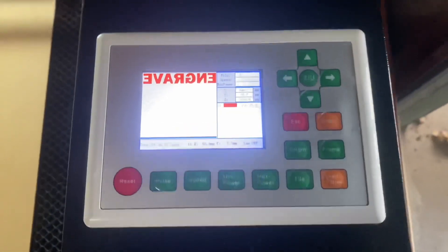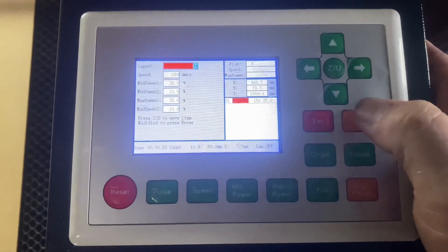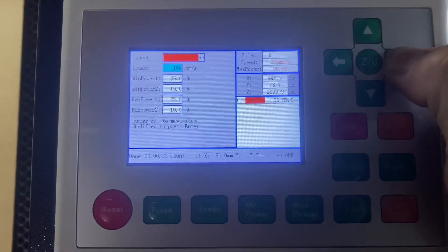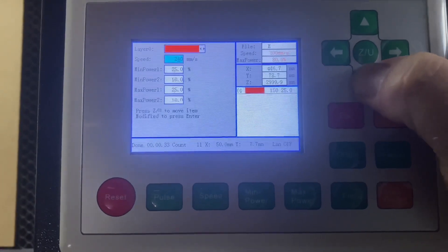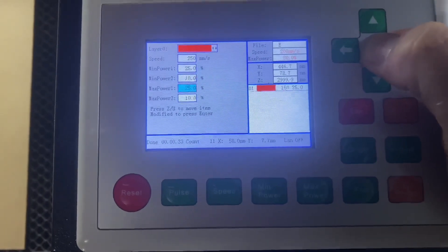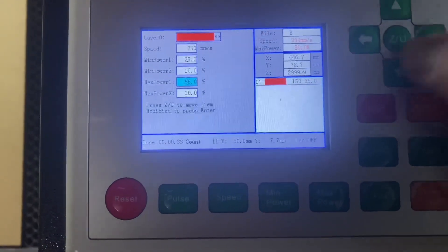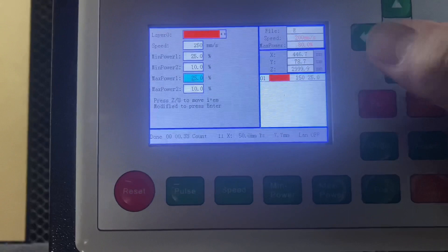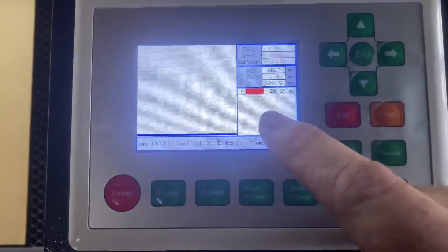Come back over the controller here. All you want to do is click on that enter button until it lights up blue, click it again, then you've got the ZU button or your menu button and you just use that to bring it down. Then you can use your arrow key to move that cursor over - it's a bit hard to see but there is a cursor there - and you just move that along until you get to where you like, then you can move those numbers up and down. The max power setting is where you change your power - at the moment that's on 25. You can move the cursor over with the arrow key and change that. I'm just going to leave it on 25 and change the speed from 150 to 250.